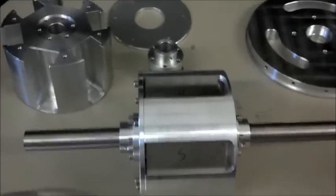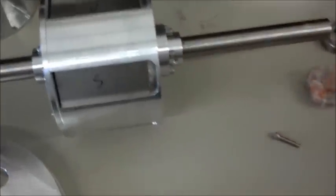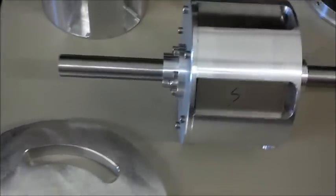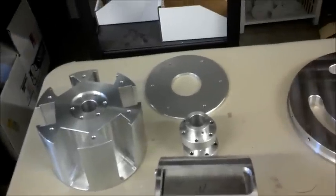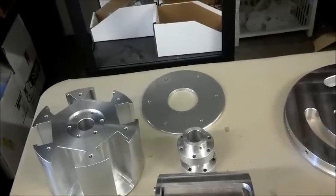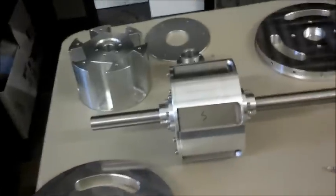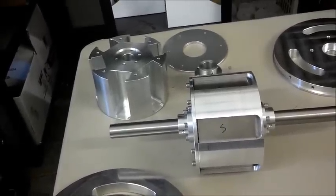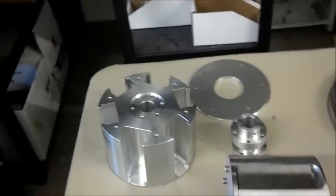Three sets of coils will be provided, as shown in our other prototype. This prototype is about an inch bigger — 12 inches across in diameter. There will be some timing on the outside of the motor on the end plates, which will be opto-controlled with two circuits to allow for running of the motor and also speed control. This kit will be available either with the motor alone or with circuitry as well. The motor by itself will still include the speed control circuit, but the controller part may be a separate option.